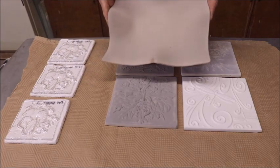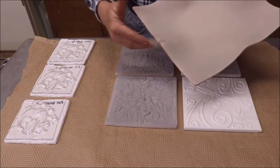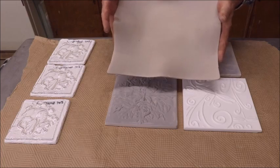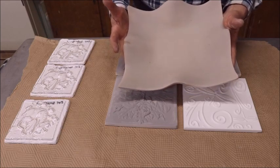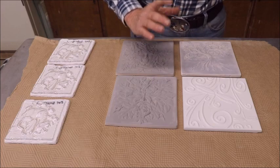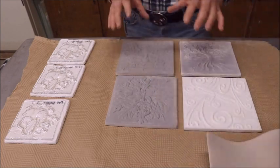This piece had boron nitride on it and it let me down — it looked perfect, I sprayed it with color in the boron nitride, and it stuck for no reason. I went ahead and cleaned this first non-texture mold, sprayed it, cooked it to 800 degrees, and I'm fixing to put it in the kiln with a piece of glass on it. It's neat — no orange peel, nothing. This is the only piece with orange peel, and I'm thinking it's got nothing to do with the boron nitride. Let's finish this part of the experiment.